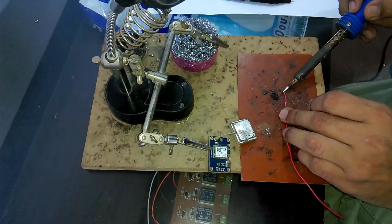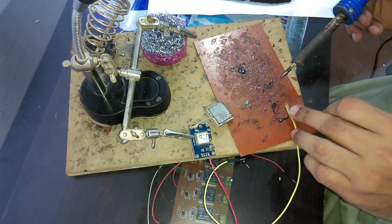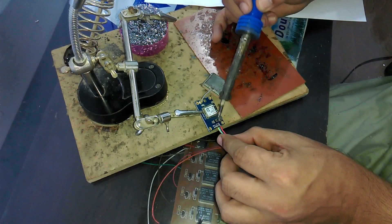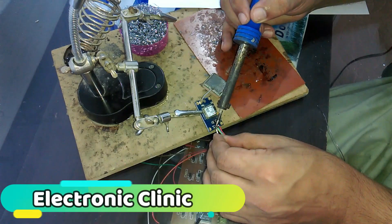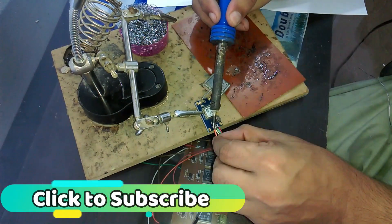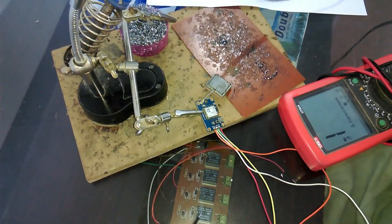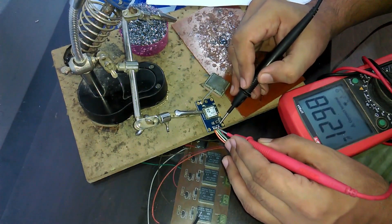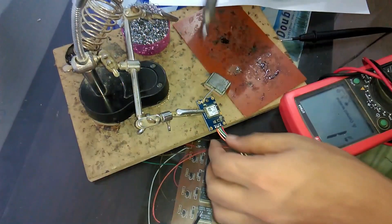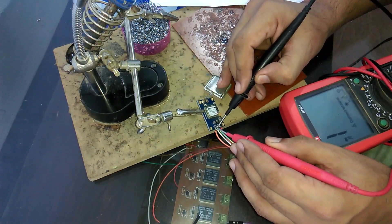In order to interface this module with Arduino we will need to solder four wires. Apply some solder to the red wire and then solder this wire with VCC of the GPS module. Then take another wire, apply some solder and solder it with RX. Similarly, take a third wire and solder it with the ground. After soldering is completed, before powering up, check for short circuits using a digital multimeter set on continuity. A beep means those two wires are shorted — use a soldering iron to remove the solder bridge. No beep means no short circuit and we are good to go.